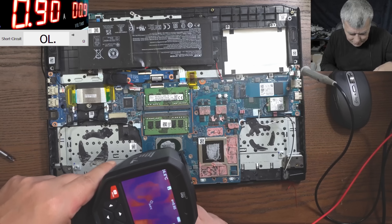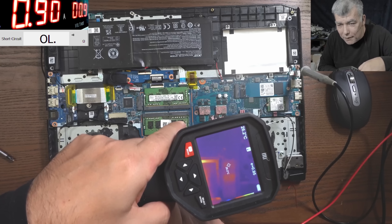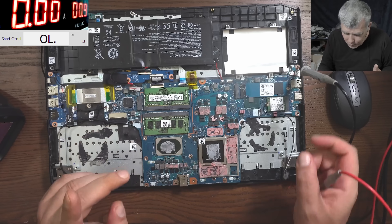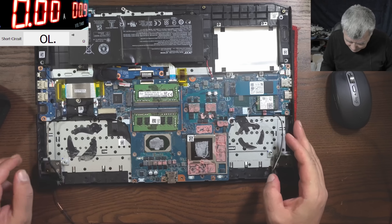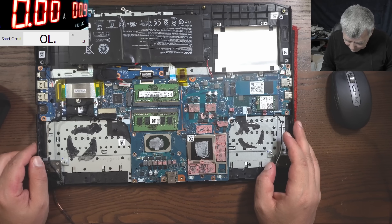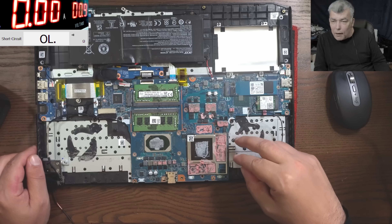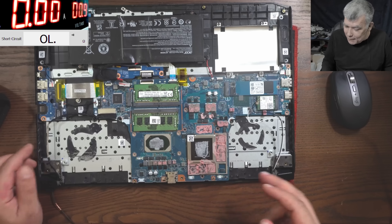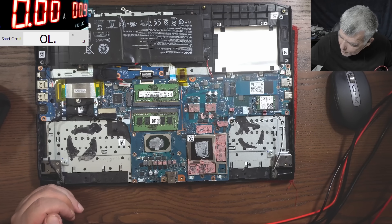Ten ohms — oh, the VRAM! I can't believe it. Check there — the VRAM. You can see it, the VRAM. It looks like it's still good because this laptop can still be used. But when you desolder those two VRAMs you'll find another dead one, and another, and so on — all VRAMs are dead. Most likely it's the Nvidia chip.